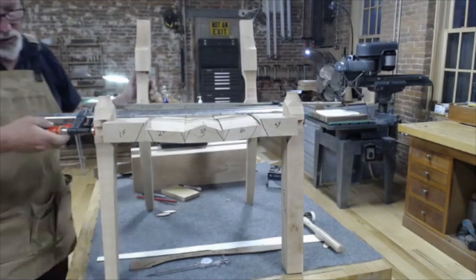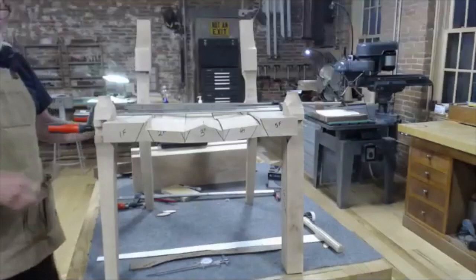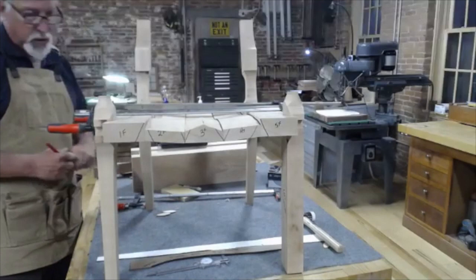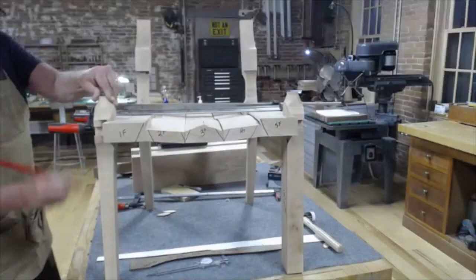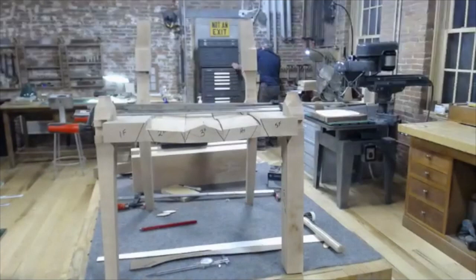and what I do, I was getting ahead of myself with the manual, trying to speed things up. But we've got to put a screw in there. I'll get a scale, I mark from corner to corner, find out where the center is, and then I drill a hole right there. And that drill is a special drill. It's a taper drill.